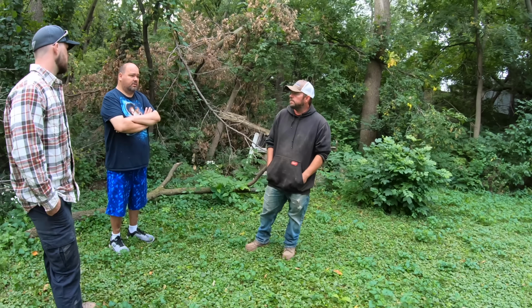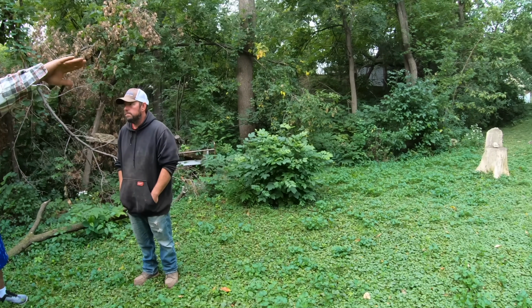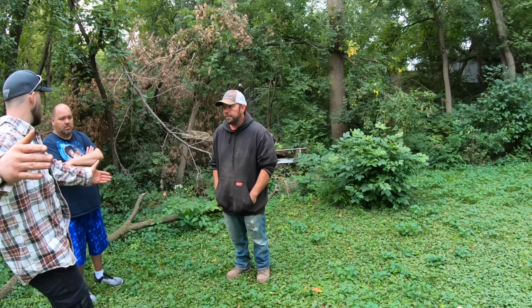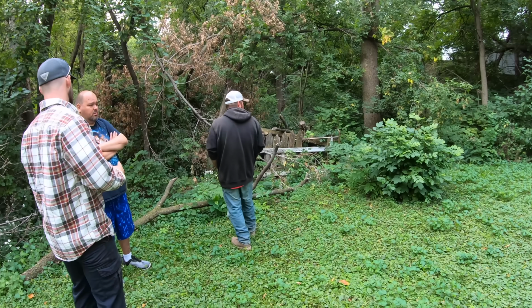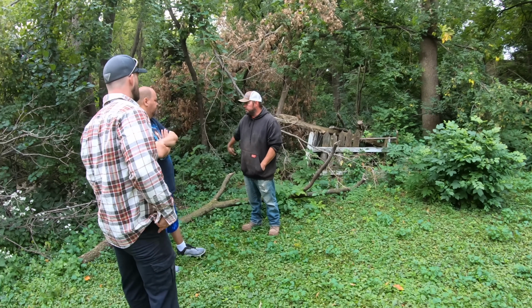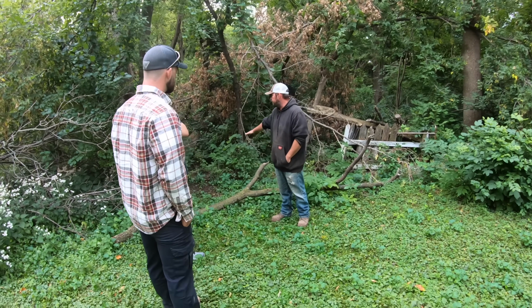So let's say we only use the netting around where the hill is going to be sloughed off on the edges here, and so it's 8 foot long. Our hill might be a little bit longer, but we could probably cover a majority of it. The rolls are 8 by 100 feet. So $4 per square yard. And we should have some silt fence on the low side here in case we start getting a lot of rain and it washes a little bit more.